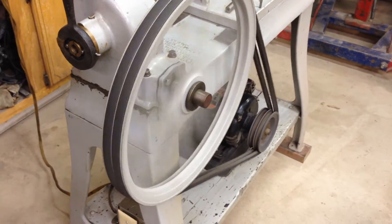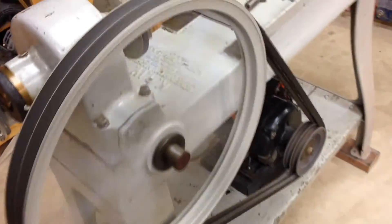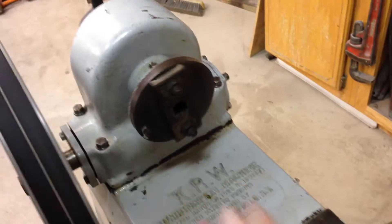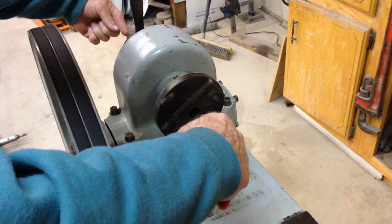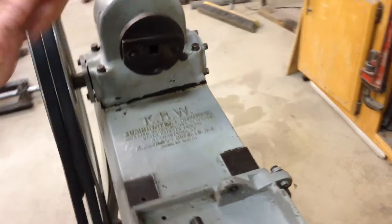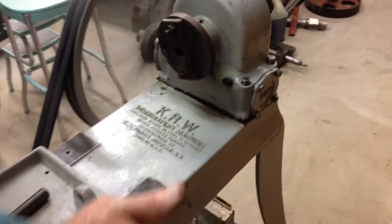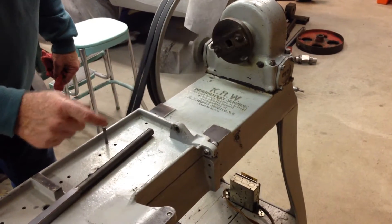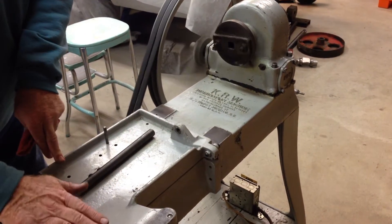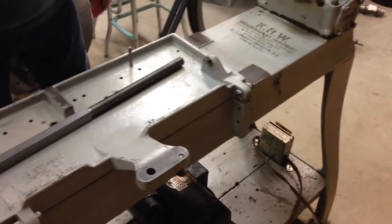There she goes. That thing flies now. You can see the gear head turning. Now when the lead screw's in here, it starts feeding very slowly. And when you put the bed plate to the side, you'll have the block in this direction and you'll be boring like this.